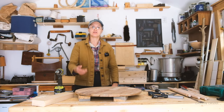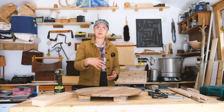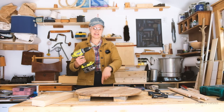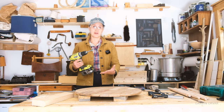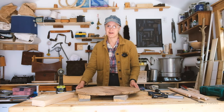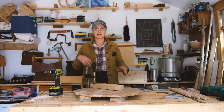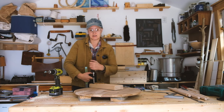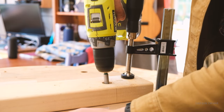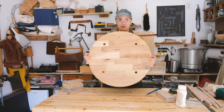The thing when you're doing this - you're using the guide initially, so when you go down, you feel the guide and the angle. But once you come down further, you don't have that kind of support anymore. Because with the Forstner bit, it's only that thick part that is actually touching the guide, and you're no longer touching that guide once you come farther down. Although I think it looks pretty good. The other thing when you're using a guide with wood like this - the more you use the guide, the more you're kind of eating the guide up. So it becomes a little bit less precise as you move along. So we got our holes.